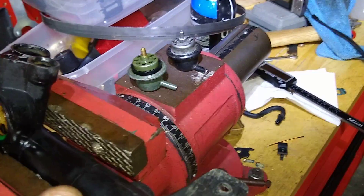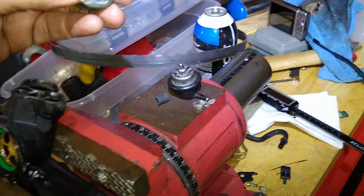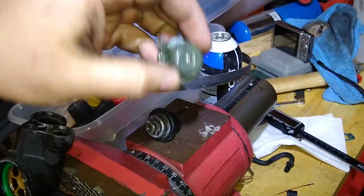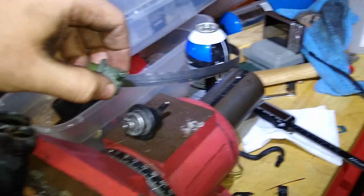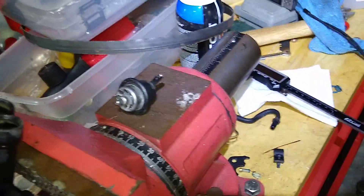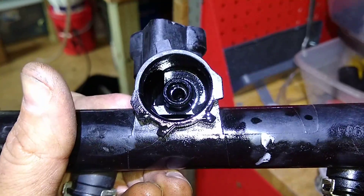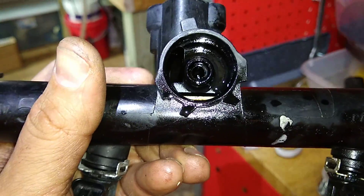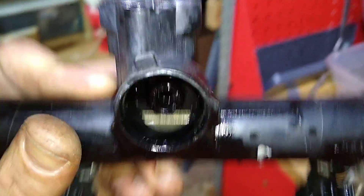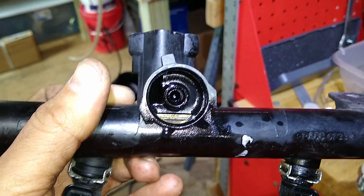Stay tuned — I'm going to show a comparison between the two of them in the truck with it running, just to show you the fuel pressure difference. This one has a hex bit, this one's like a security bit, and a hex bit here. I'm going to back them off completely in the truck and show you what it does fuel pressure wise. Before I forgot, I also wanted to show where the regulator's center hole goes through — you can bore that open a little bit as well, and that's where you'll see your bit going through down to there if you choose to bore that out.